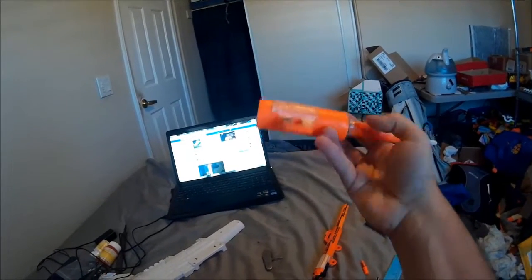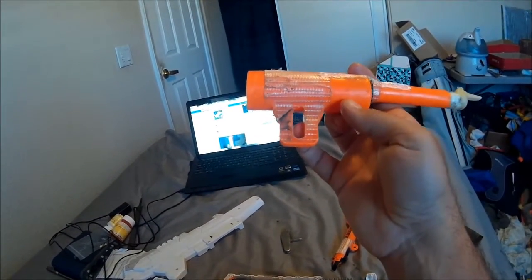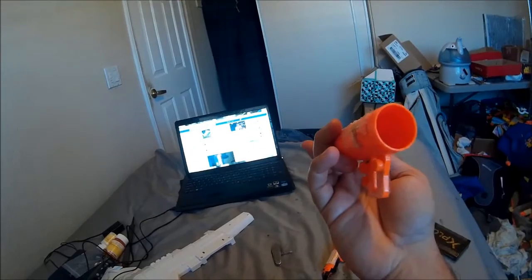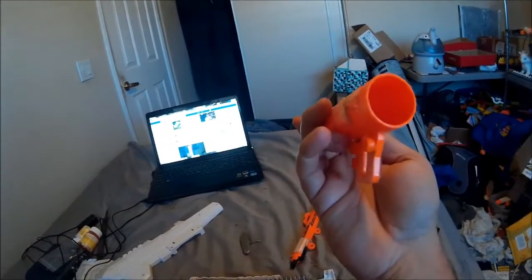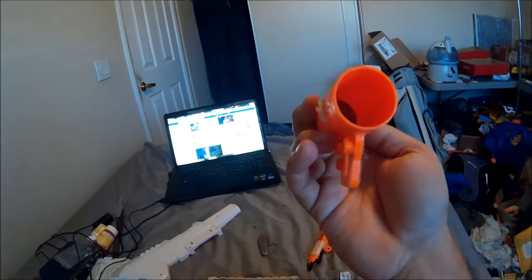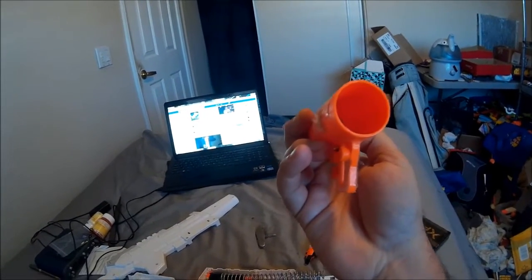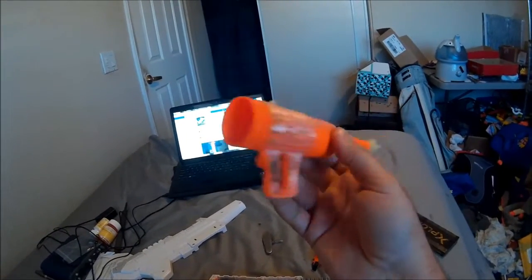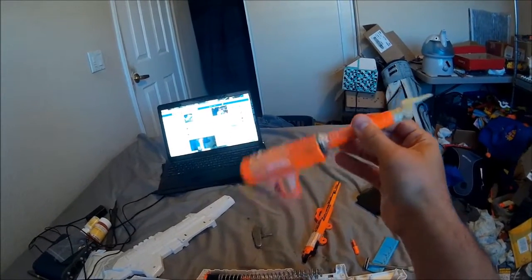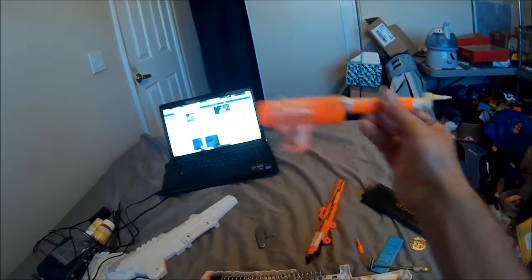And beyond that, and you can see it kind of here, you can see how far it goes. Another about 3/8 of an inch of it is a pad of silicone. That's solid silicone. This is how my plunger heads don't break. That's solid silicone going into a piece of 430 ID, 1/2 OD aluminum. That goes into this, that goes into here, and that is how it works. But I do use this outside here to guide it in here because that's better for feeding.